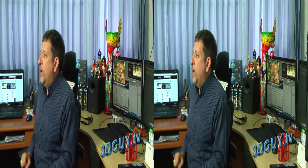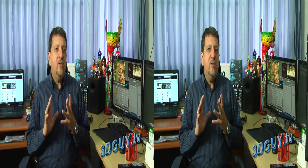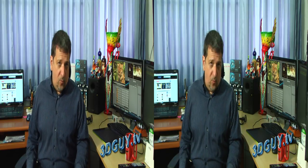Now let's talk about what you get for all that. The deinterlacing is extremely high quality. With their patented Pixel Motion deinterlacing algorithms, the result is a vastly improved image quality while maintaining vertical resolution. With your up and down conversions, you get clean, smooth lines without any of the usual jaggies that you see in so many other converters. With cross conversions, the unit will add or remove cadence from 3-2 pull-down 23.98 or 24 frames per second film sources to give you beautiful video results.